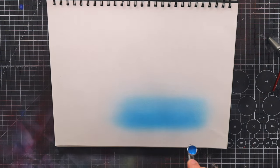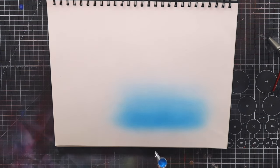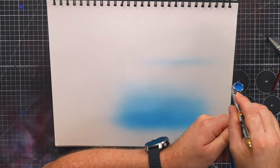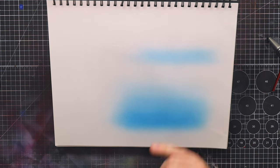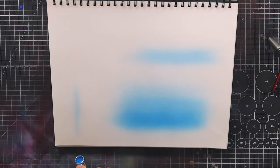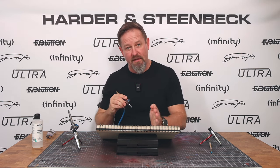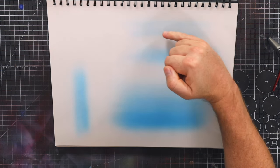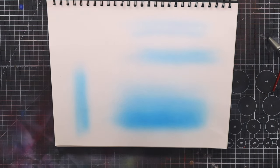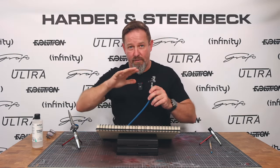Now we've got a color grade that's really nice and gradual. If we want to fade it out more at the top, come a little further away and just think of it as dusting the color on. Now we've got a really nice gradual color fade. The key is: the first stroke goes down, second stroke I aim at the edge of the first, then the edge of the second, then the edge of the third — that gives you even coverage. Same thing working in vertical strokes. Don't lay the stroke down and then try to join them up, because you end up with a band in the middle where coverage is uneven. Put the band down, second stroke, aim at the edge of the previous one.